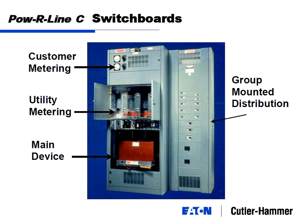One thing I'll say on utility metering though, it used to be, and I say used only a couple of years ago, everything in the Xcel area here, primarily we'd put a metering compartment inside of the switchboard. And recently they have since changed, and Xcel now puts their utility compartment outside. So there's companies like AMP or EMI, if you're familiar, local tin vendors will make these little CT cabinets you can take, put it on the ground, and that allows Xcel to access that without having to go inside the building, and get the owner to get them into the room and get into the cabinet or what have you. So that's just one of the changes that they've implemented recently.